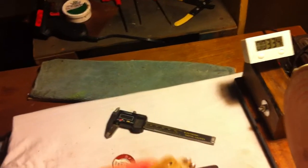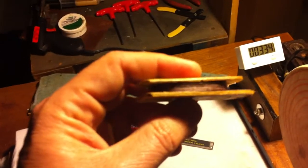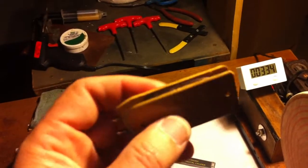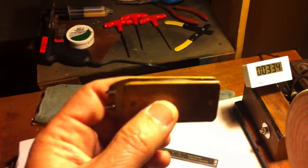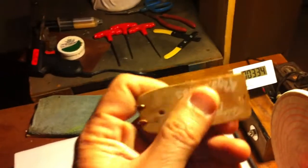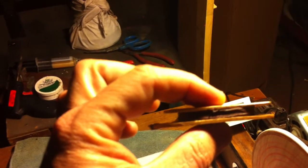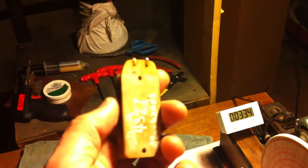This is some veneer that I had — I bought a box on eBay of just scrap veneers — and I laid it up, laminated it together, and made my bobbins out of that. What I did was I just glued a piece of ceramic magnet with some epoxy onto them. Then once it was laid up after a couple of days, that's when I went ahead and put the start lead on and wound it up.